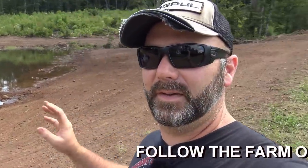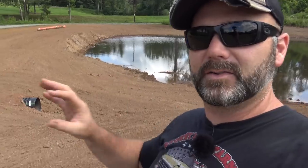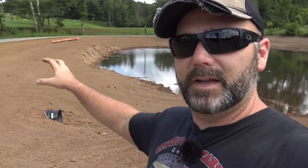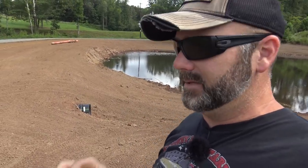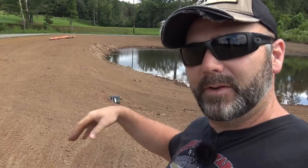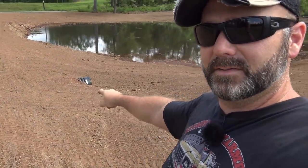If you've been following the pond build, it looks so much better. We posted something to Instagram about cleaning this up and smoothing it out with the Ventrac. We're going to go over it one more time to prep the seed bed — the ground's already soft, and we'll hit it with the landscape rake to stir the soil so when the grass seed hits it, it falls down into the soil rather than just sitting on top. It's very important for the ground not to be too compacted — though we do want our dam area very compacted. This is our pipe that runs through the dam; stick around to the end of the video and I'll tell you exactly how it all works.